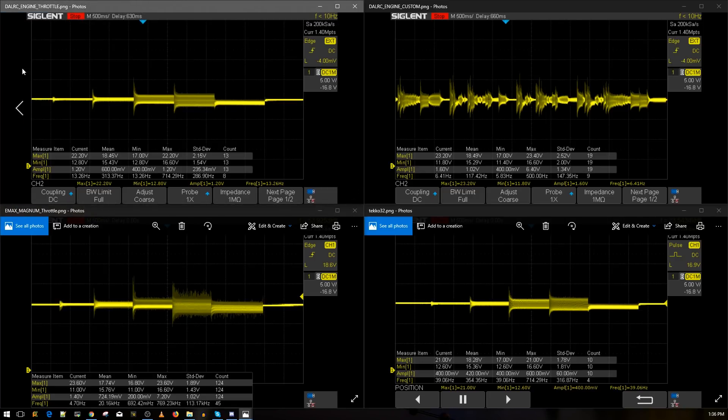Now looking at the DALRC Engine, every single capacitor on board was active filtering that one test motor. It's still a very good and informative test though. It does show this ESC is potentially performing very well. This does not fully simulate real-world conditions — testing 4-in-1 ESCs properly requires four motors running simultaneously, which I don't currently have the correct equipment for. But these bench tests do give us meaningful insight and allow us to make an educated comparison between ESCs.